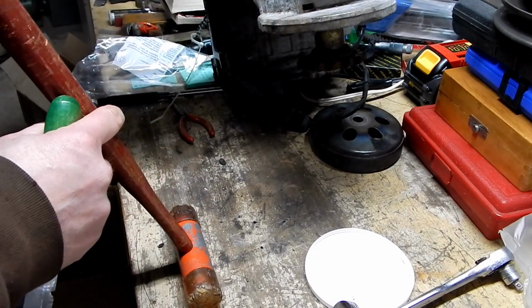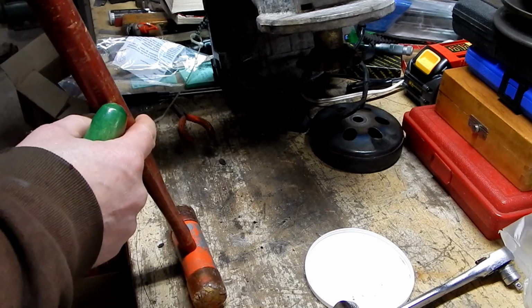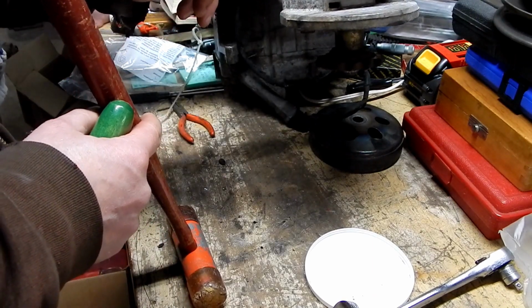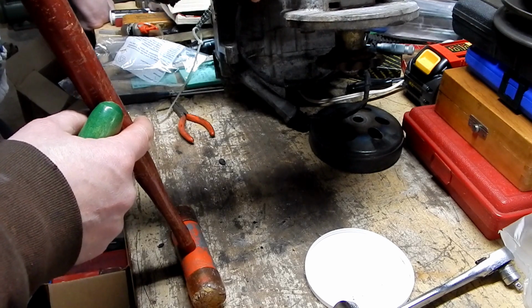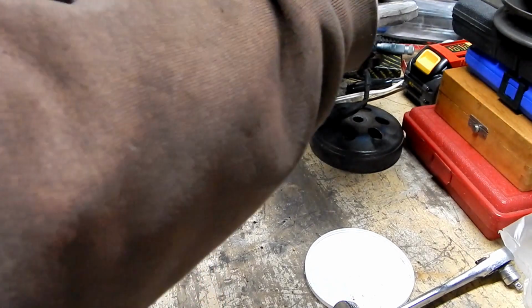I think that, the way that there's no dipstick on this back gear case, the way you know if there's enough oil in there is you drain the oil from here, put this back in, then take this out and fill oil until oil spills back out of here, and that's how you know it's at the right level. That's how a lot of gear cases are, and differentials. Which is why that's what I believe. And the fact that that's separating now tells me I'm probably right.